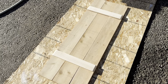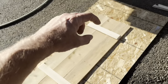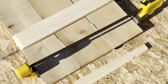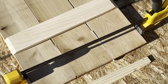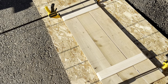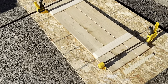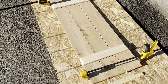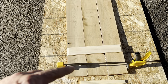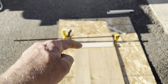Now I'm just going to put the spacers in there. I'm going to have to decide how far down on each one to come in. The paint sticks were too fat, so we're just using popsicle sticks for spacers. This wood as it gets older is going to shrink up a little bit, so those gaps will slightly grow — so it's kind of accounting for that as well. We're going to go 7 inches from the end to the bottom of that board, and same thing for that side — 7 inches.